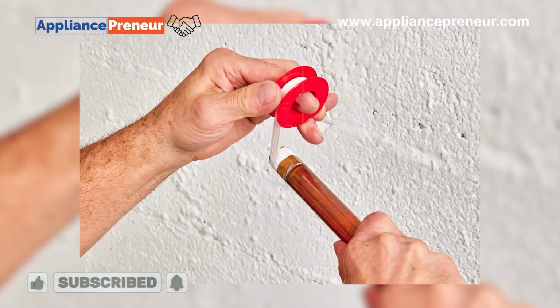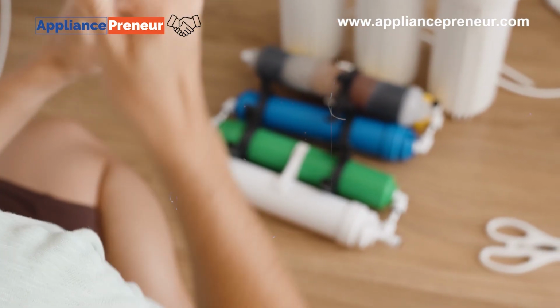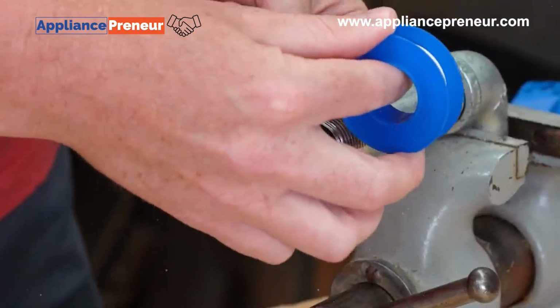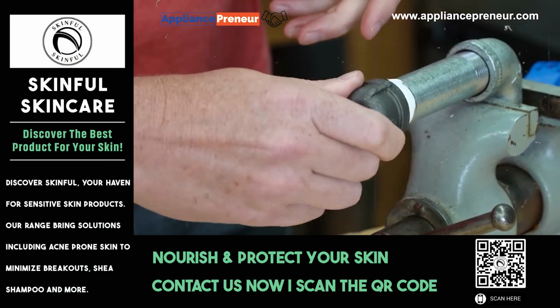Teflon tape, or plumber's tape, is a simple yet essential tool for creating watertight seals. This thin tape is wrapped around the threads of pipes and fittings to prevent leaks. To use it correctly, wrap the tape clockwise around the threads to match the direction the pipe will turn. This way, the tape stays in place as you tighten the connection.